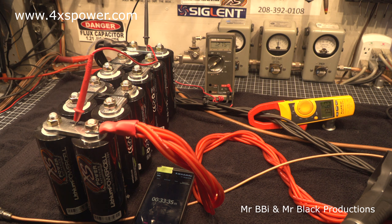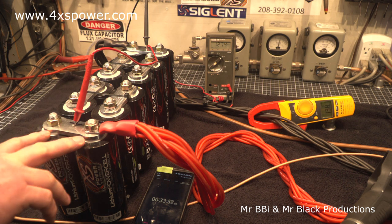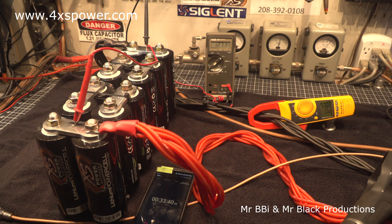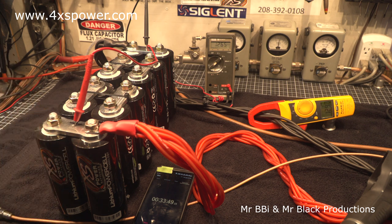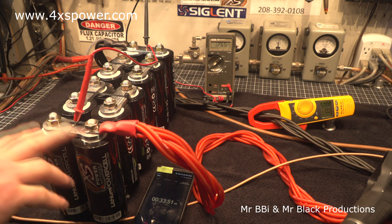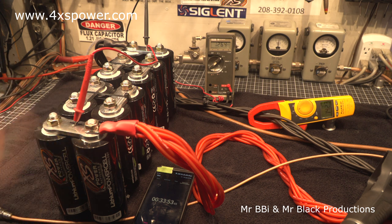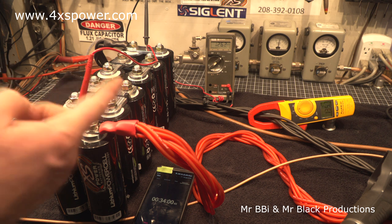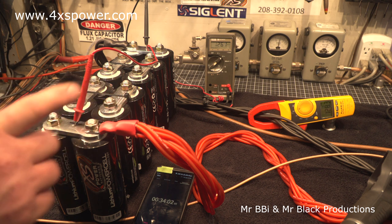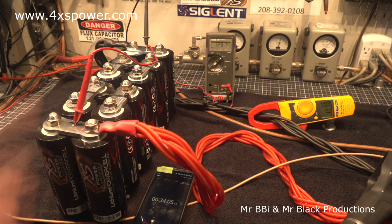What I mean by that is that you can tie this in tandem with the power supply at your house instead of going out and spending like $5,000 on a big ass power supply. You can run on batteries. These don't vent. They don't put off any gas. They require no maintenance. They're semi-puncture resistant in this form. They make them in a puncture-proof cabinet. They're water resistant. But you can literally attach this underneath your bench, and as we've shown here on video, you'll have enough current to run a 16 pill for over a half an hour without even having to turn on the power supply, and your voltage will stay up.